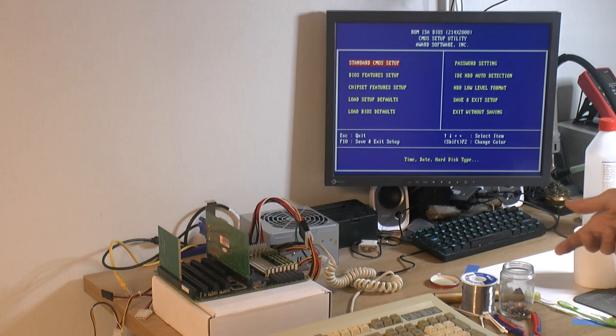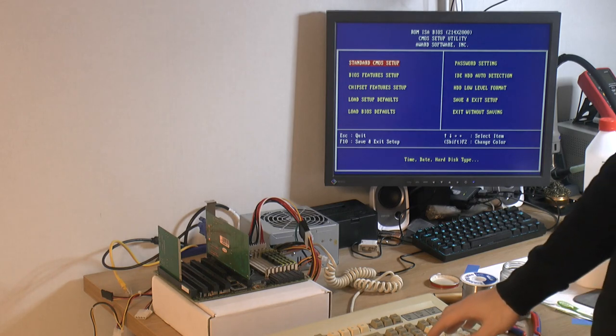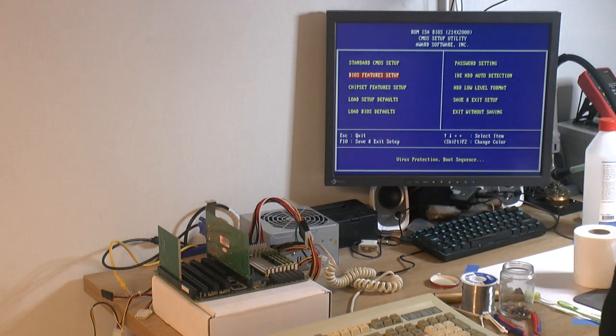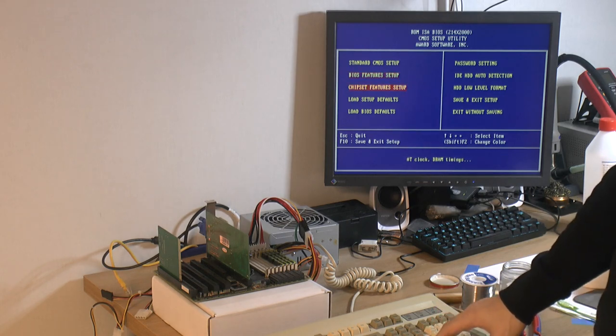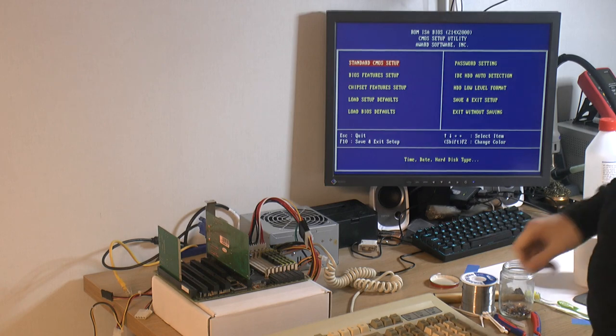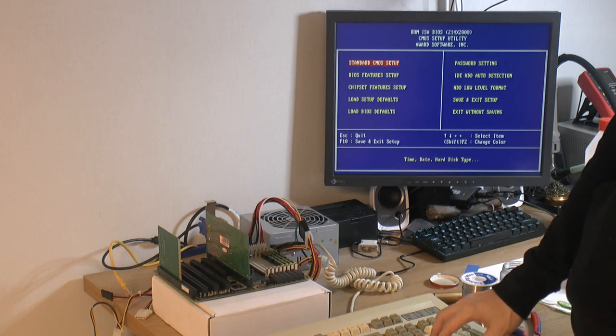It was kind of unusual considering the level of corrosion. I've seen a lot less corrosion with traces completely gone. Oh, it could also have been something with the CPU. I did drag solder there because it looked kind of bad. Anyways, my vote is on the socket. Replacing that would probably make it boot, but you do want to remove the battery acid or it's going to keep eating and destroy everything.